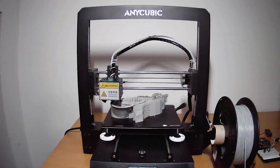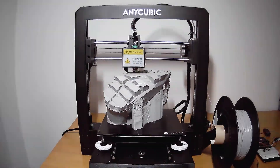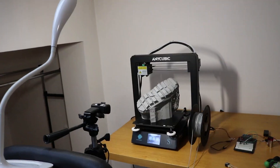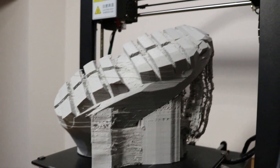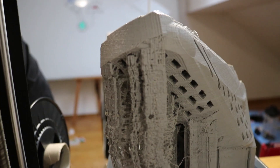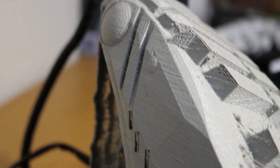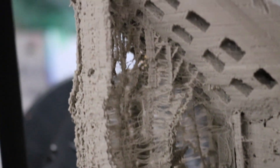Even after adding the secondary extruder I was under adrenaline the whole time, checking every few hours. I was really impressed by how my FDM printer performed because I didn't know it was capable of such a task — until I came back 3 days and 20 hours later to find this. It's just astonishing. The 0.2 mm resolution was the right choice, and the TPU filament stuck really well. Even though the support under the toe box wasn't perfect, it did its job.